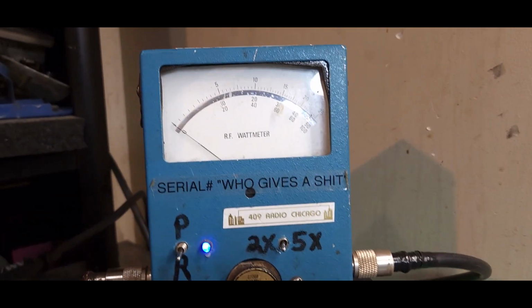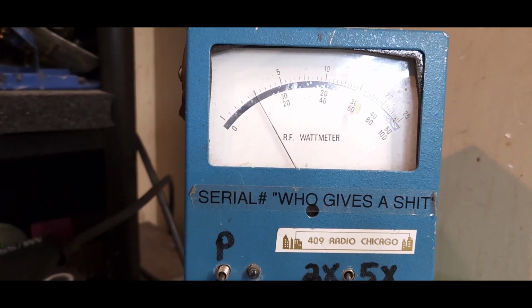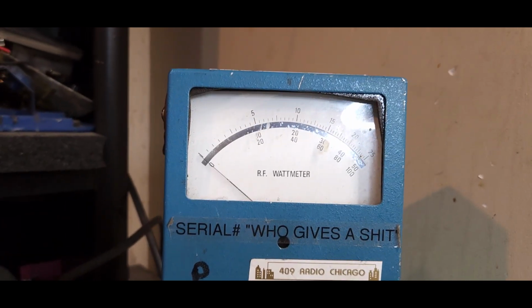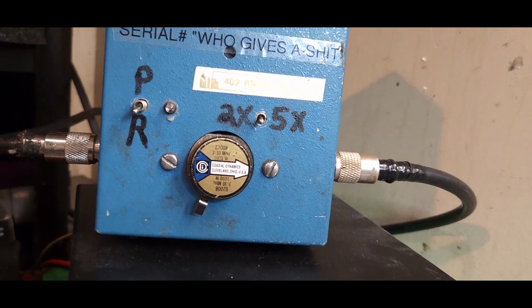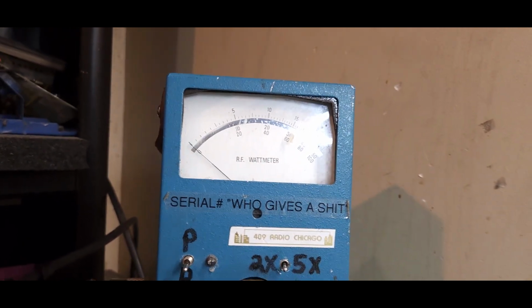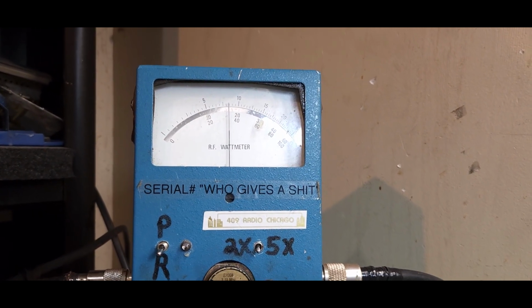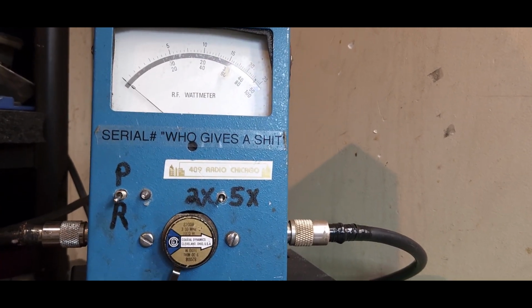Let's look at the RMS. This guy's an RMS junkie, so we're gonna give him RMS. 1,000 watt slug. With what we're hitting it with right now, it's doing a little over 100. Oh, I think we got a little bit of squeal, maybe, no? No, saying right around 100. Now, it will do more. There's 300 watts. It's all a matter of how you drive it, okay? All I did right now is turn the carrier up on my actual radio.